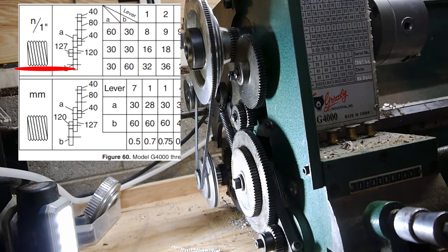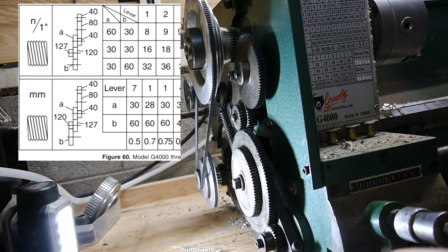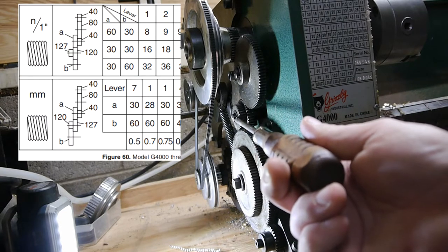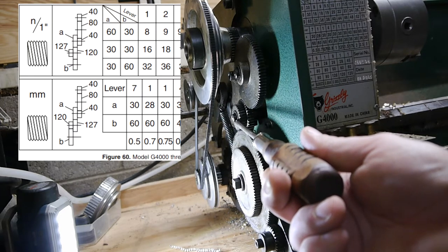So, two things to make. If you look at the graphic, it kind of lends itself to understanding. But let me point it out. So, this is standard, right? This bottom gear here needs to be on the inside. There's a spacer here that was on the back side when it's metric. That spacer is on the front side when it's standard, and it drives the 120 tooth gear. The 120 tooth gear drives the B gear, which is connected via a square cut key, if you will. That's not quite right. They broached it with a square shape instead of a circle.